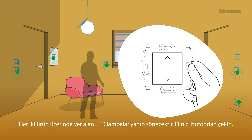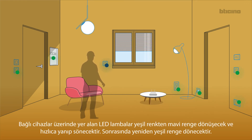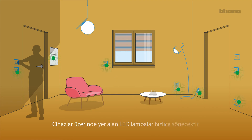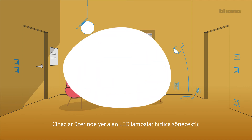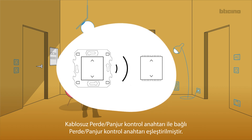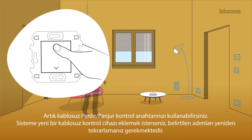The LEDs of the two devices flash. Release the wireless control. The LED of the connected device goes from green to blue flashing, and then back to green. Press and release the two control keys of the in-out wireless control at the same time. The LEDs of all the devices immediately turn off. The shutter wireless control is now associated to the connected shutter control.